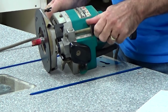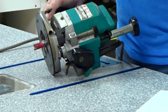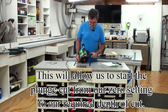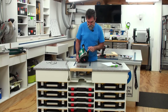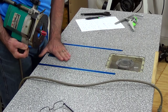You can adjust the depth. I'm going to show you a picture of the actual clamp plate placed in between the top of the turret and the depth stop. What I've done is wound this depth stop down until it actually holds onto that clamp plate — that's the exact thickness that I want to plunge to. Once I'm there it's just a matter of plunging the router. As I plunge I release the clamp and plunge down about four mil, because that's how I like to do it — four mil is about the max. Then I'll plunge again and it will eventually stop when it hits the turret, and that will tell me that I've got the exact depth I need to go to. The plate will finish up flush in the bench.